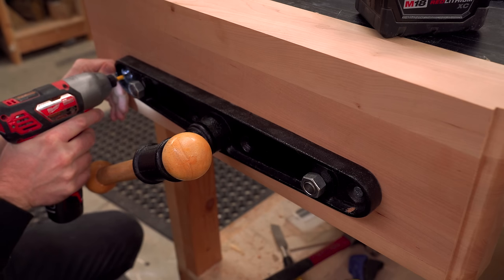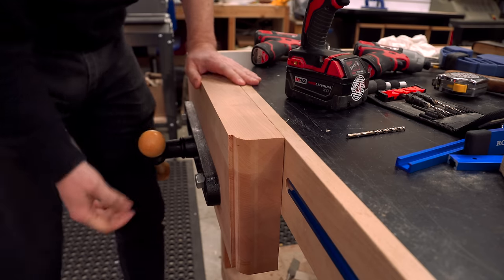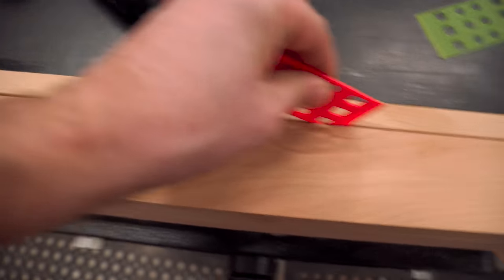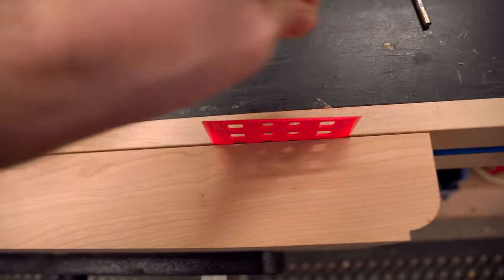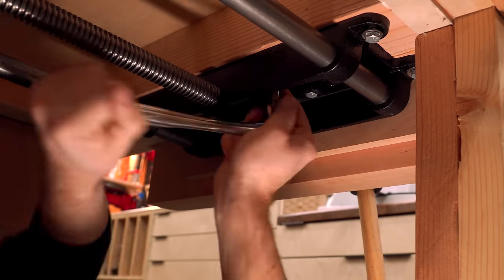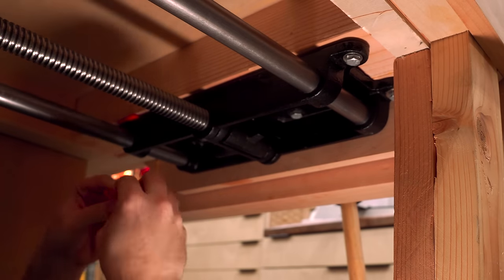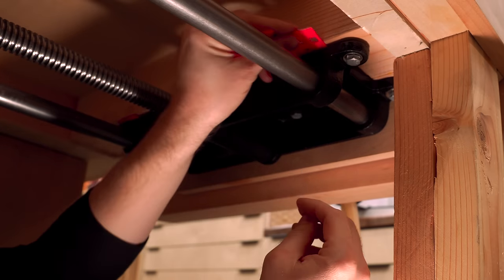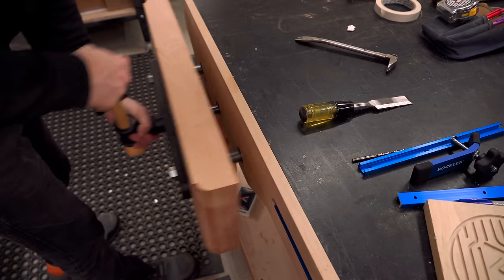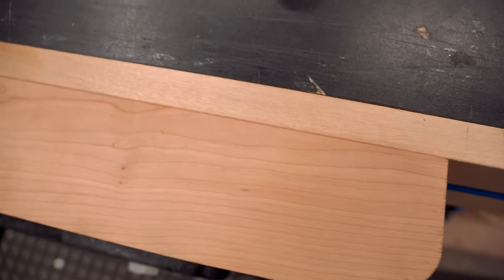With all four sides permanently attached to the table I can now focus on tuning the vise jaws — these were not perfect when I first installed them. The big jaw had a gap on the left side and a big gap at the top versus the bottom. These gaps need to be corrected otherwise the vise won't work well especially for thin materials. For the big jaw, I loosened up the lag screws and inserted some shims at the back. I'm guessing the reason was that block I glued in probably wasn't perfectly planed to the existing two by four, but once it was tightened up that fixed the problem. There was enough play in the bolts that as I tightened I was mindful to twist it a little bit closer on the left-hand side, and as you can see that gap is pretty much gone.